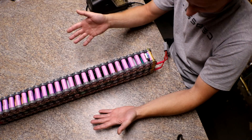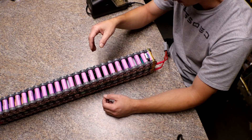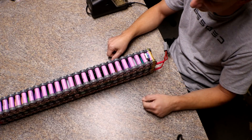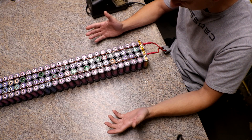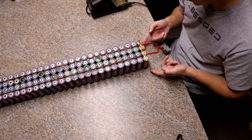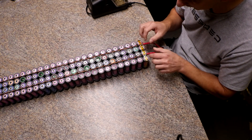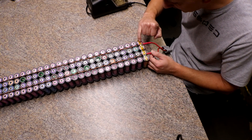Guess what — there is a broken fuse. I think I broke some the other night when I was doing the live stream because I was really excited and I think I was pushing too much pressure up here on the positive side while I was checking all the voltages so many different times. I saw it on one of Peter's videos where he put the fuses on the negative side and put the negative wire up on top to help prevent those from moving. I'm going to do that — hopefully that will help keep these from breaking anymore. I think it's only one fuse, right here.